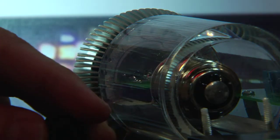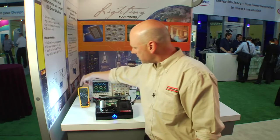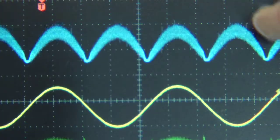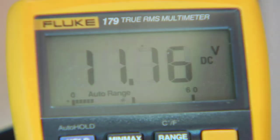This chip has the ability for analog dimming input. This represents the LED voltage — the voltage across the load — and as I drop it, you'll see the current will drop as my intensity also drops, and you'll see the LED voltage also drops.